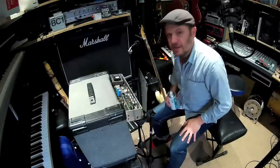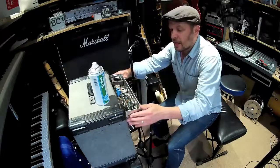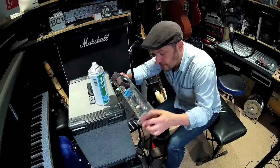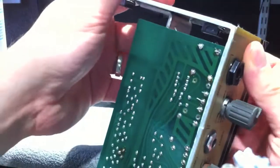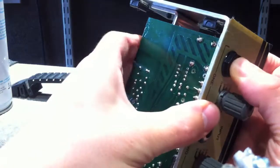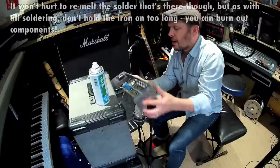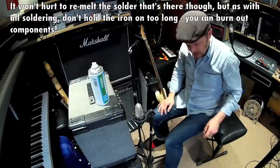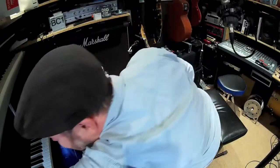I've just seen a little bit of dust flying there, so that's not going to help anything. I'm just going to check whether the connectors here are moving with respect to the circuit board — this one doesn't seem to be. I'm going to put the amp back in, switch the power back on, and see if that problem has gone. Nine times out of ten you'll find that it has.